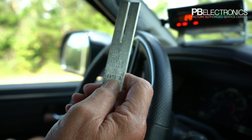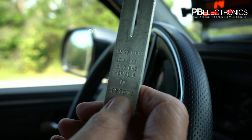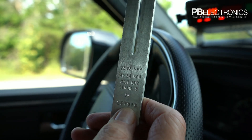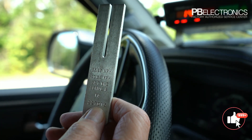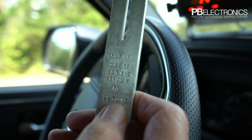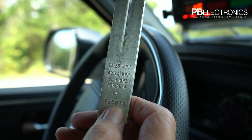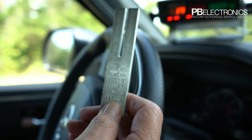Notice it says 34.7 gigahertz, which is Stalker's frequency. If you try using a tuning fork with a different gigahertz reading, you will not get an accurate reading on the radar — this tuning fork is specially designed for this radar. All K-band tuning forks work on all K-band radars at 24.1 to 24.5. Ka Stalker is 34.7, Kustom is 35.5, MPH is 33.8, and Decatur is the same as Kustom.